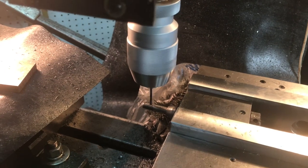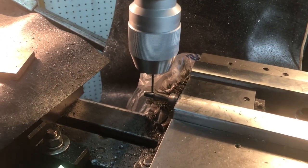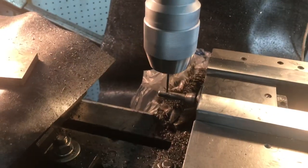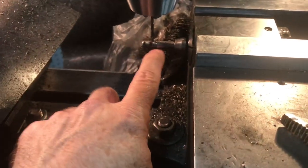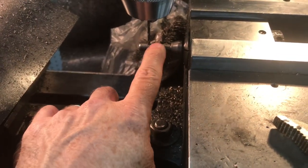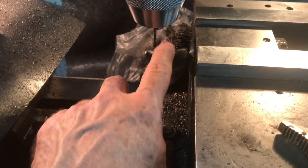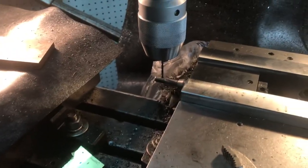In this segment I'm drilling a hole for the locking pin - it's a 3/32nd inch diameter hole, drilled about 150 thou deep, which is about half the diameter of the 5/16th inch rod. I'll take that out and show you the finished product in a minute.